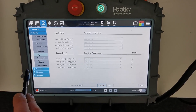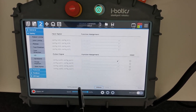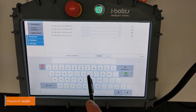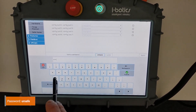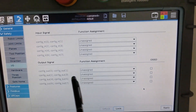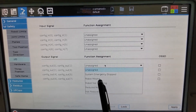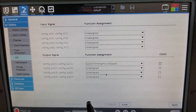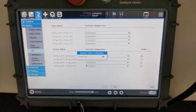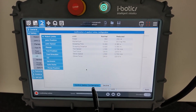Go to the Installation tab, then Safety I/O. On the output signal, first you have to enter your password. The standard password is URSAFE. This then allows you to change those settings: configurable output 0 and configurable output 1. Choose 'system emergency stopped'. Apply, then Apply and Restart, and Confirm.